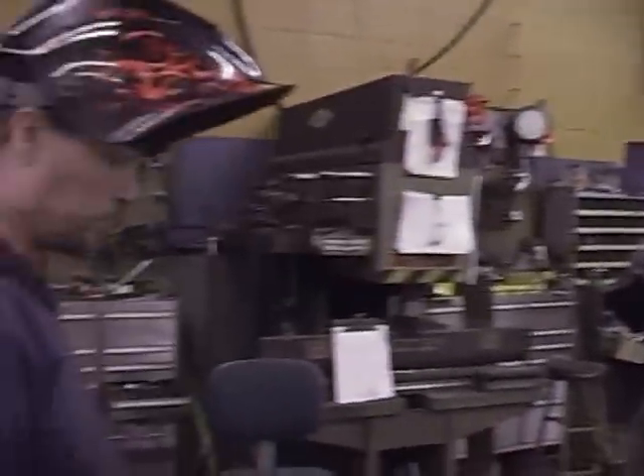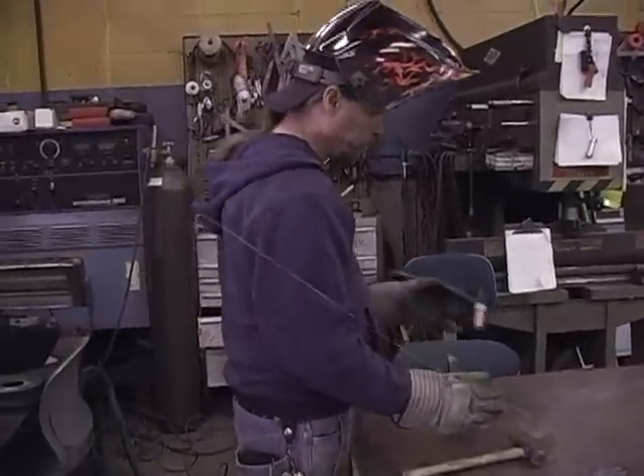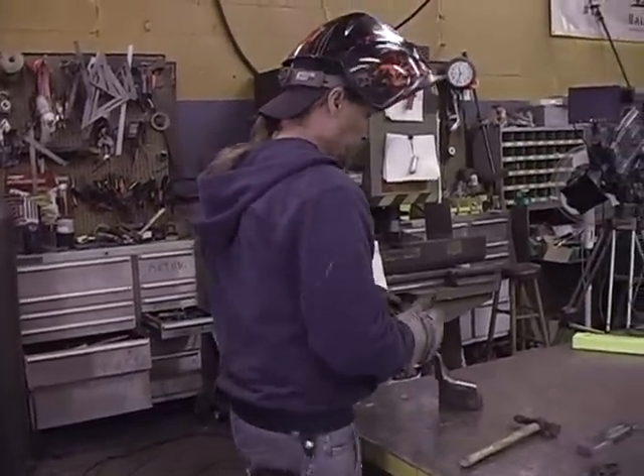What we're going to do is Tom's going to put this on this piece of hot D2 and he's going to weld on there and he's going to peen it. As he goes along, he'll go about an inch or so, then he'll peen it with a hammer, and that stress relieves it as he's welding.